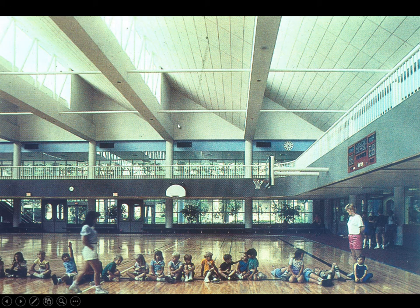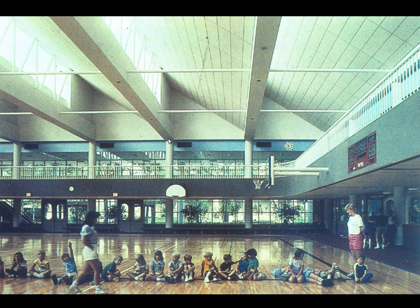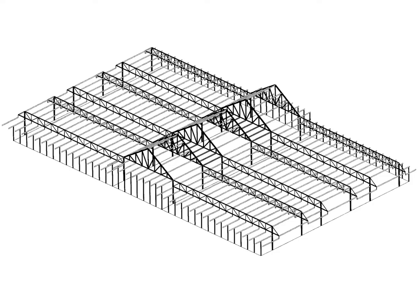In this case there are additional volumes that serve as ductwork for the system. Here is another version with either north or south facing sawtooth. We like to mix north and south glass because north glass tends to even out the light while light from the south aperture can be highly variable. So in this case we have trusses in the south aperture, trusses in the north aperture, alternating across the building.